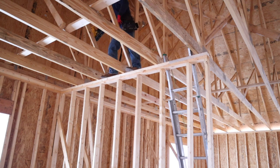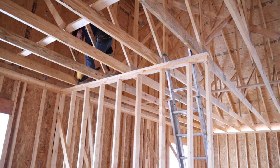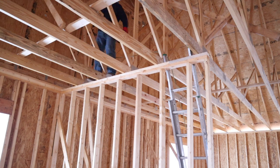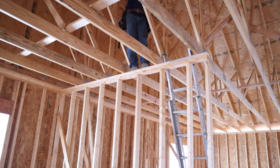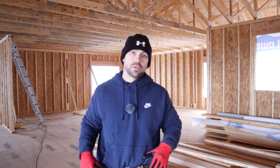You just got to learn to climb like a monkey and you'll be okay — climbing around up in these trusses. But all jokes aside, it's relatively safe if you have some experience. Instead of carrying your nail gun down the ladder, you can just lower it down using the air hose. So I got a whole pile of 16-footers here that were too twisted to use, so they're going to be perfect for braces. If you're building a house and you come across some 16-footers that aren't perfect and you don't want to use them for plates, be sure to keep those because they're perfect for bracing.